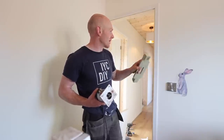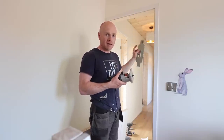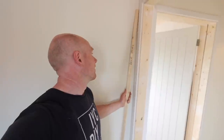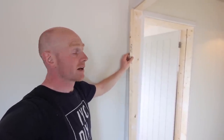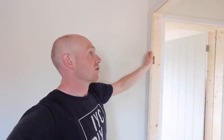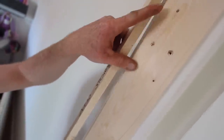Where it gets a little bit harder is where you've been a numpty and put your architrave on because we were just trying to rush ahead. So a lot of these were just the linings, which means I could have put the jig onto the lining and routed out the inside in here. Instead, I'm going to have to go back to my method, which is to mark up our hinges and then freehand it. This is my door story stick — I used this to set my door linings because we were setting them on top of our finished floor. So this is the exact height of our door lining. I've marked it up for our hinges: the top one's six inches down, bottom one's nine inches up — that's kind of what our old Victorian house was and I've just stuck with that. So I'll get that in position, transfer those lines onto here, then we'll mark up the hinge.